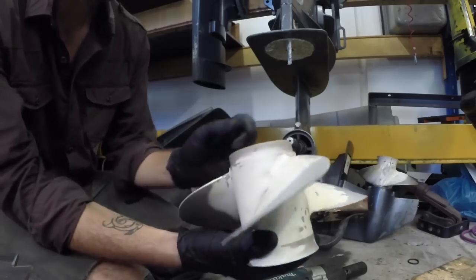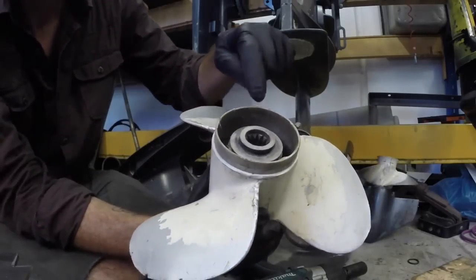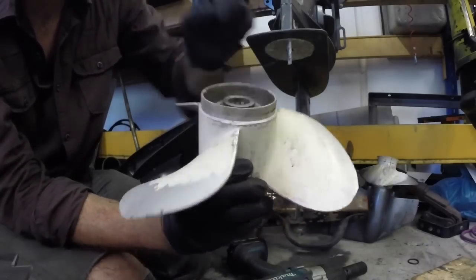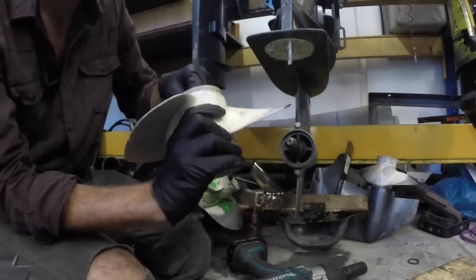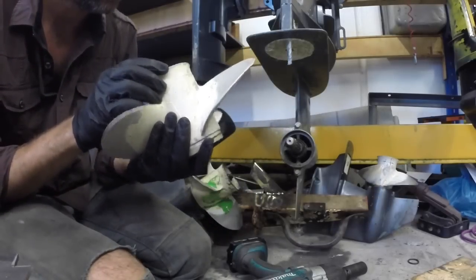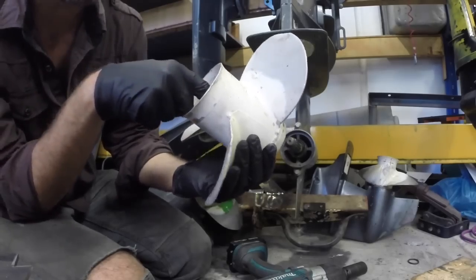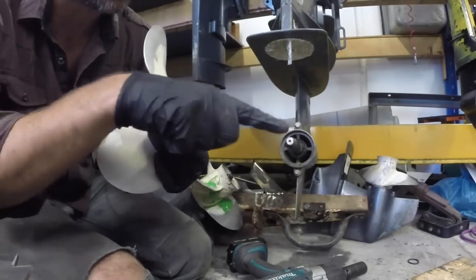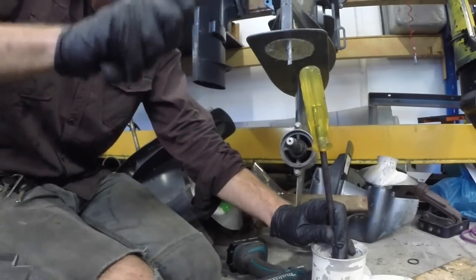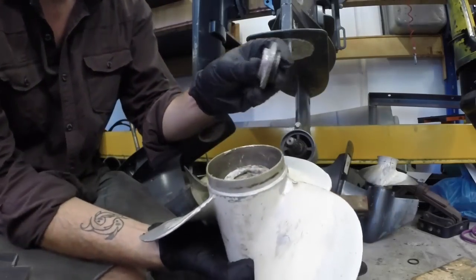Now just to break the old grease. On the back here you can see this is actually the thrust washer that's come off from the gearbox itself. So make sure if it does stay with your prop that you retrieve it. This one actually feels just as stuck as the prop was — there's a little bit of a lip in here. So I'm going to get a thin screwdriver and just come in from this side of the prop and hook it and push that washer out. There we go — that's the thrust washer out.